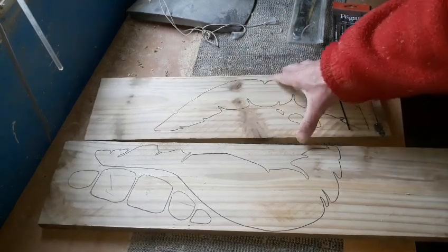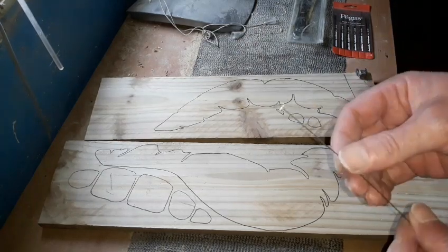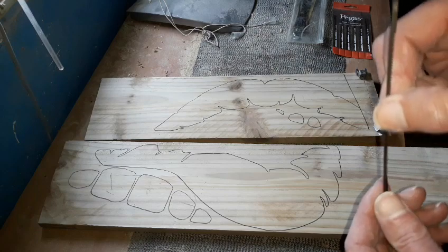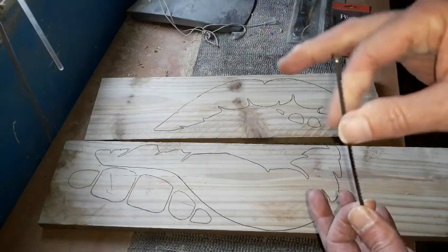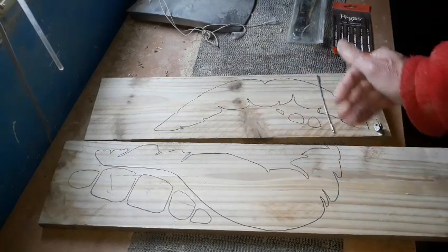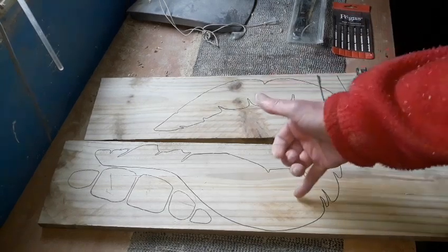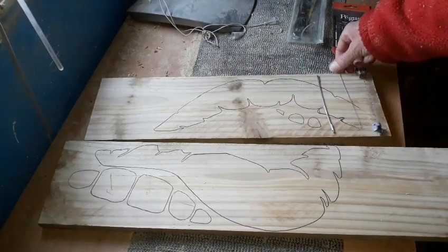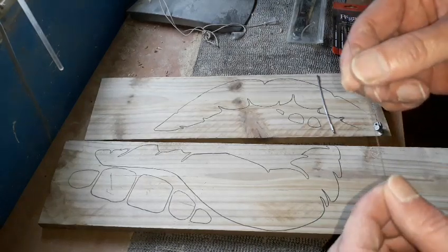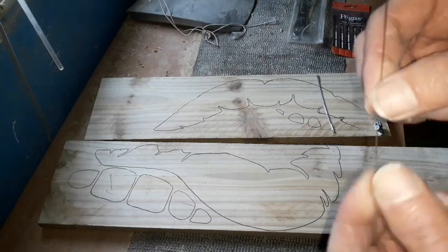The blade I'm going to use today is what they call a spiral blade. You basically get three types of blade. You get a pin blade - it's called a pin blade because it has a little pin at either side. It cuts from the front and you clip it on at the bottom and at the top. They come with your basic cheap scroll saws. They're an okay blade for somebody starting, but if you're doing detailed work you would have to start drilling pilot holes into the wood. This allows you to feed the blade through, so you'll need a pinless blade - exactly the same kind of blade, just cuts at the front, but really small with no pins at all.